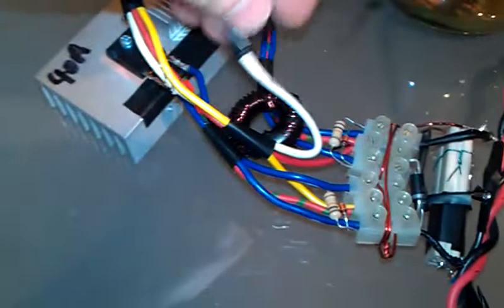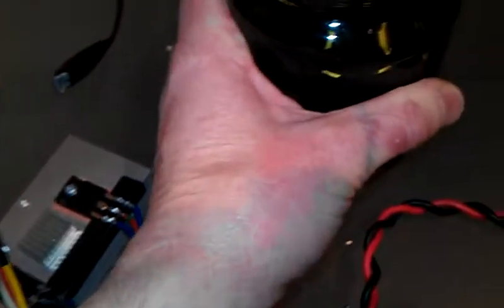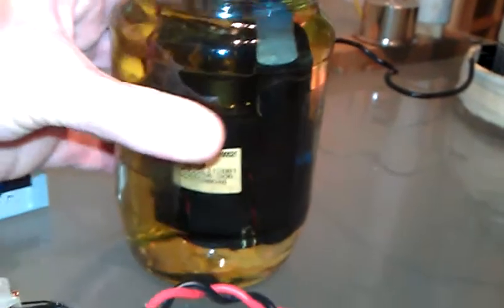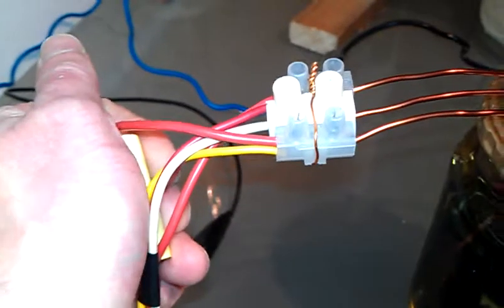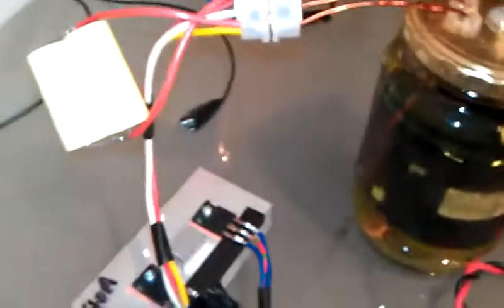Something's arcing out. Holy cow, that wire's getting warm. Damn. Some nice arcs off that anyway, isn't it? I was getting worried — hold on one sec — because something was... yeah, it's this thing, like this is really really hot. I'll have to make that wire a bit thicker. That's fine because that flyback's in oil, so I'm not going to get any problems from there. This is just warm here. The capacitors are not too bad — they are 400 volts at 5 microfarads, there's two of them in parallel.